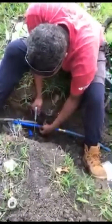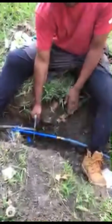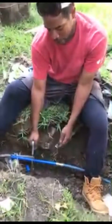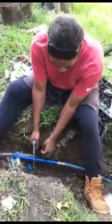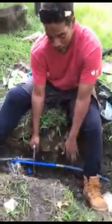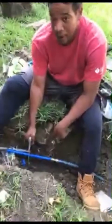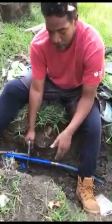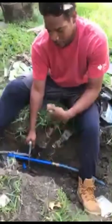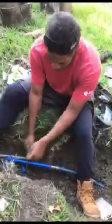He said, what was the problem? It sprung a leak on the irrigation system. This was the irrigation system that the main water was hooked up to, and this is PVC, so it popped, and now I gotta connect the main water line back to the main water line into the house. This had a T splitter on it, so it ran from the meter to here, and then through the T valve and into the house.